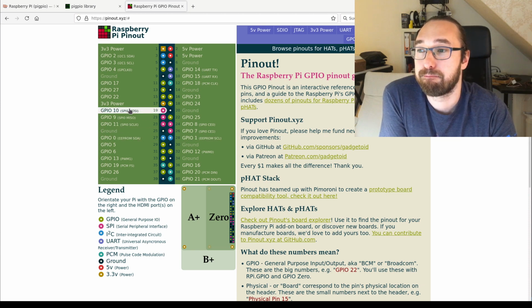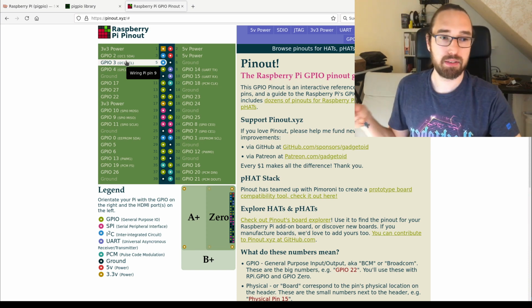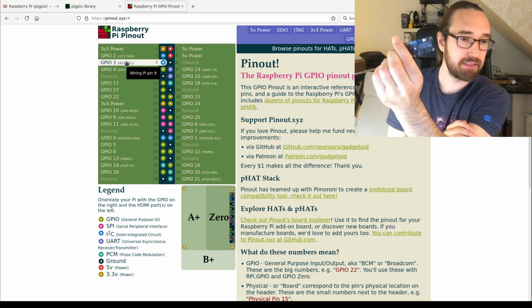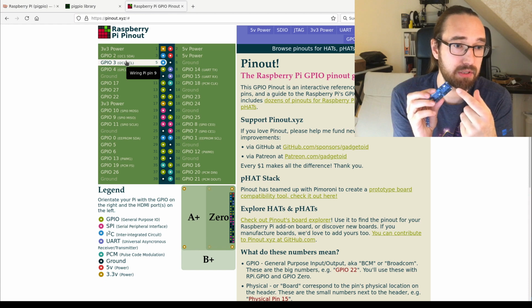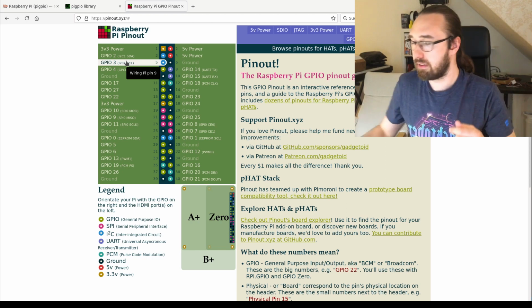It has I2C. I2C is an embedded bus, and there are a lot of chips. For example, I got one here. This one is a servo controller. This is a USB I2C controller, but this one is from Adafruit. It can control servos or PWM, 16 ports, and is controlled via I2C, for example. And you can connect that to a Raspberry Pi and control it.